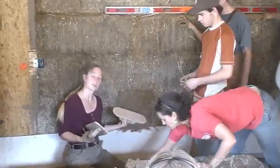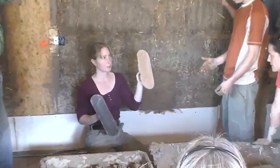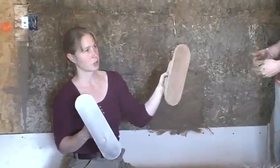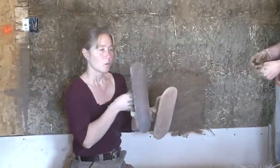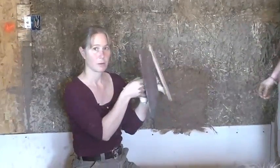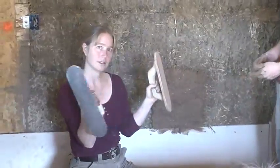So different tools will leave different surfaces. This is a wood float — it'll leave a little bit rougher surface, leave some open pores, and sort of peel the sand up just a little bit. A steel trowel will push the sand down. It's like finishing a concrete slab — you can push the sand down and bring the clay or the fines to the surface and give more of a seal to the finish.